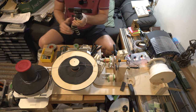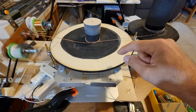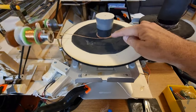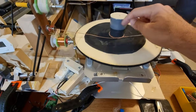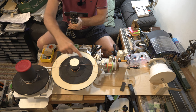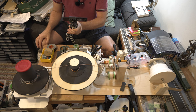What has been added is this device here, in addition to the original spool. What it does is pull the material off the spool to prevent speed changes — wire would otherwise coil around here, changing the diameter and increasing the spool size, which would change the feed rate and cause the windings to start to separate a little bit.